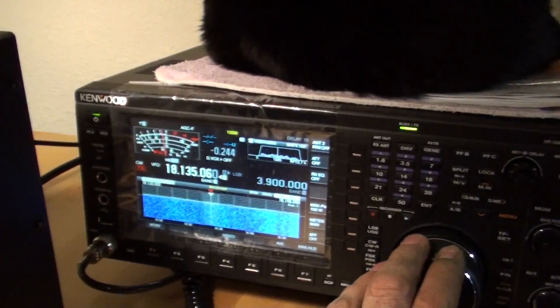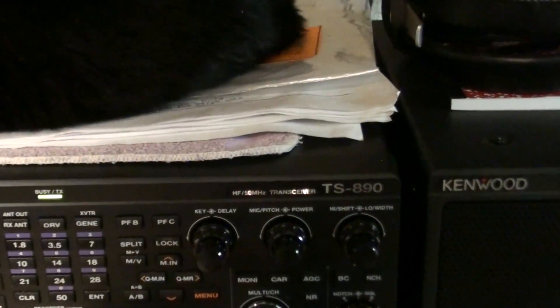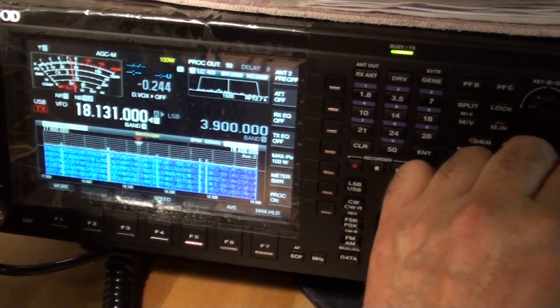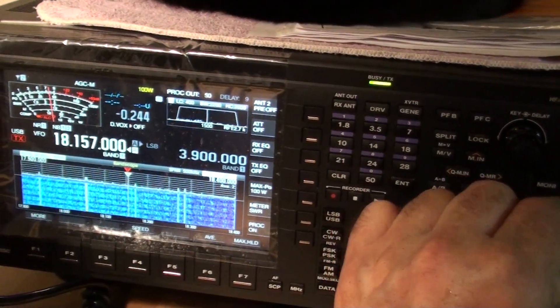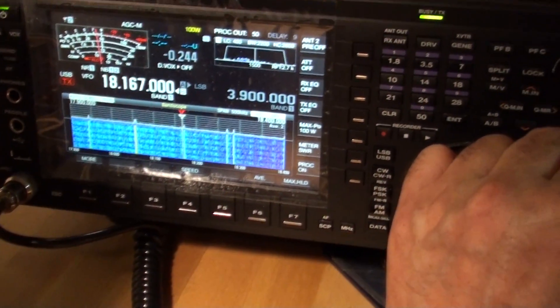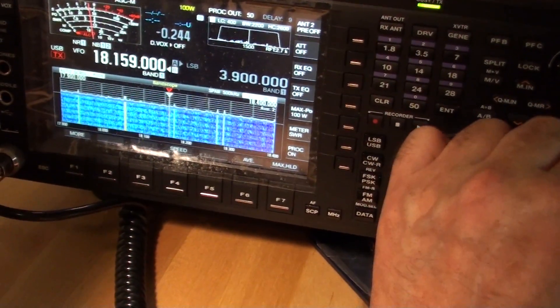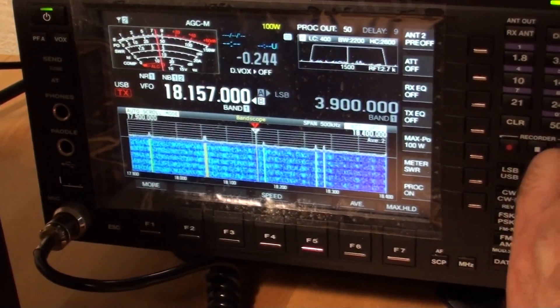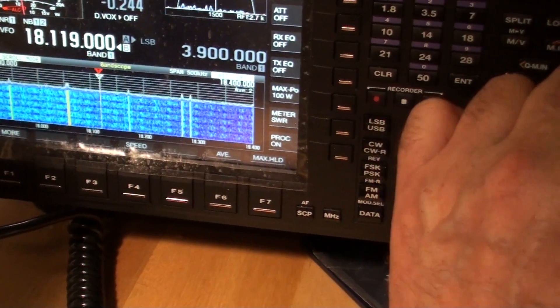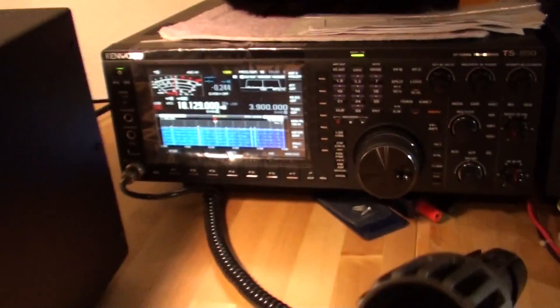1400 watts forward, 32–34 watts reflected — that's okay for that little wire antenna. I don't know if it's getting hot, or if I could use it tomorrow. The band itself seems pretty dead. I need to be on upper sideband. I'm not seeing any real activity. There are some birdies and a few stations across 18.110 to 18.167 — it's a small band. I'll wait till morning to see what shows up. Pretty easy — 17 meters done easy. See you guys later.